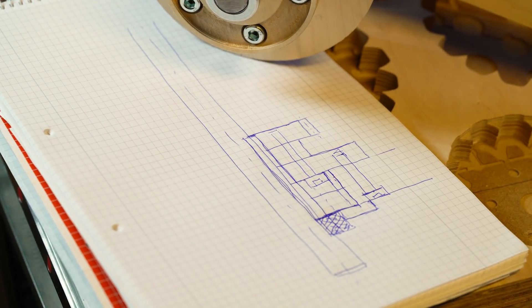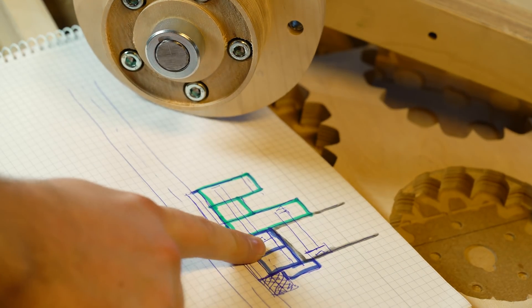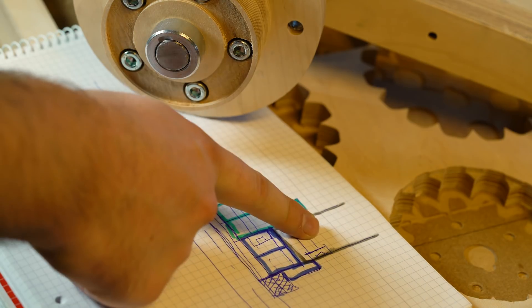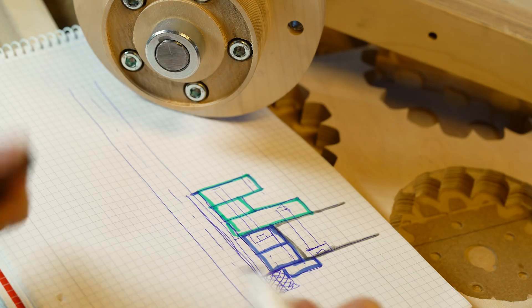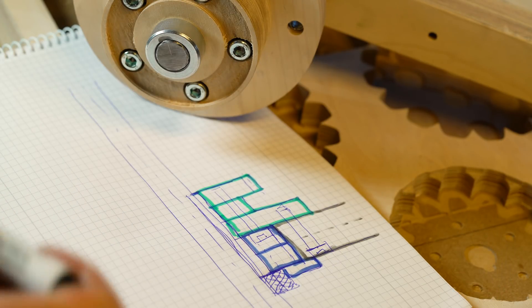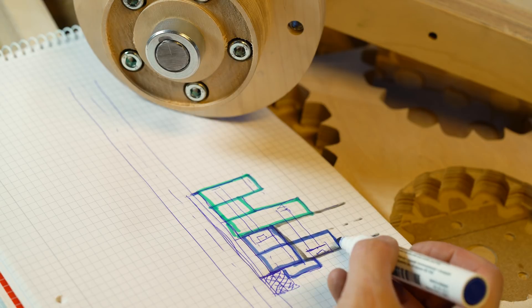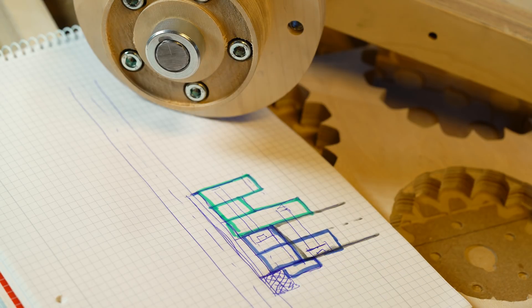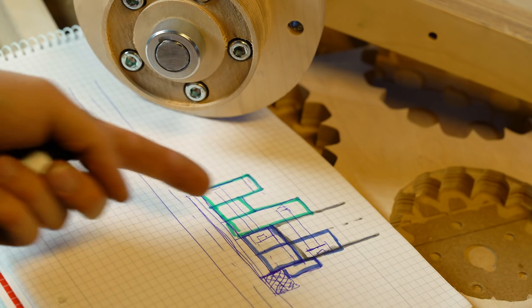So what's your idea here, Marius? Part of the assembly should stay on the shaft — it's centered by the blue core that you can take out, and fastened by screws that go into the green things. What if we split the two layers of 18mm plywood and make them different sizes, so the blue covers this area and we don't have that joint? Then the screw will also retain the blue and clamp the gear.